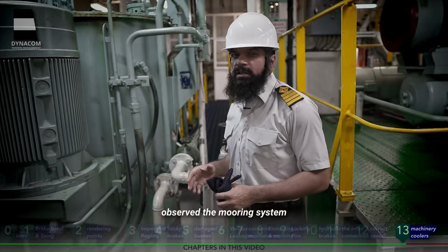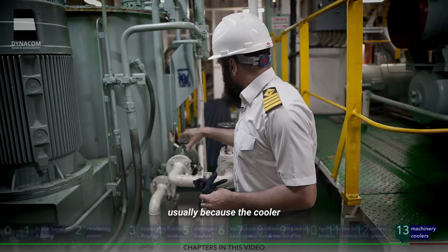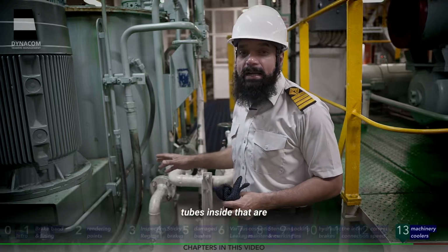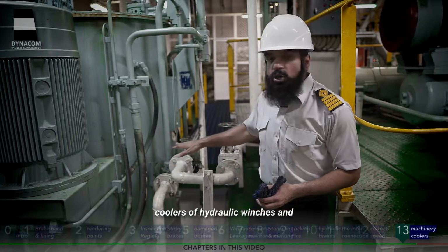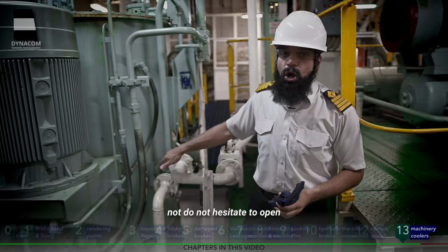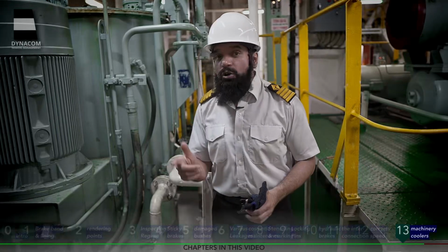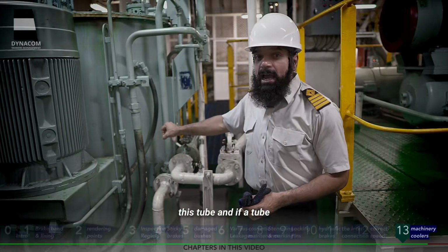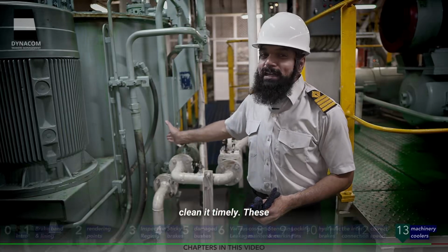Also, it has been observed that the mooring system trips because of an increase in temperature of hydraulic oil. This is usually because the cooler of a hydraulic winch is either not properly cleaned or there are some tubes inside that are clogged. The PMS clearly states the interval at which you have to clean the coolers of hydraulic winches and windlasses. But if you are in any doubt whether your cooling system is working properly or not, do not hesitate to open and check it, especially if you are coming from an area where there was river water. Even a small straw that goes inside can clog a tube, and if a tube is clogged, the efficiency of the cooler is reduced. So make sure to clean it in time.